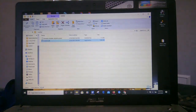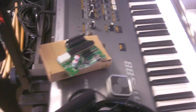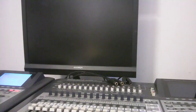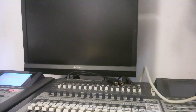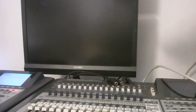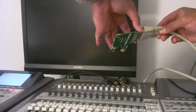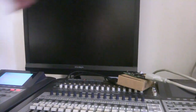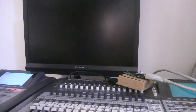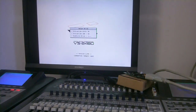Now we're gonna go to the VS in my studio. I have two VS machines and we're gonna plug it into my second machine. You have to have the DB25 cable, or there's a way you can connect it right to the board. Some people open up old SCSI CDs and connect this to the inside — I actually tried that but it's fine like this. I'm just gonna make a little case for it. Now we turn on the VS and I want you to see exactly how long it takes to load.